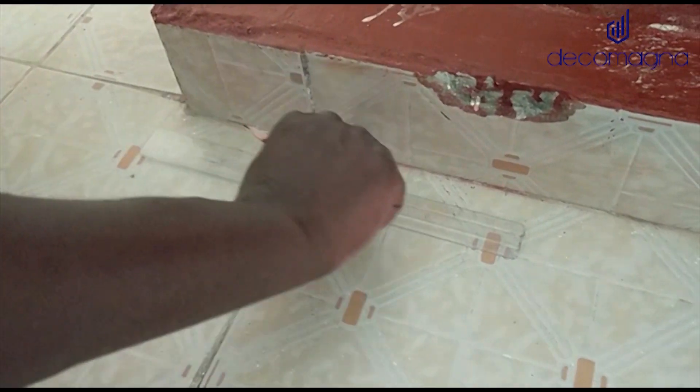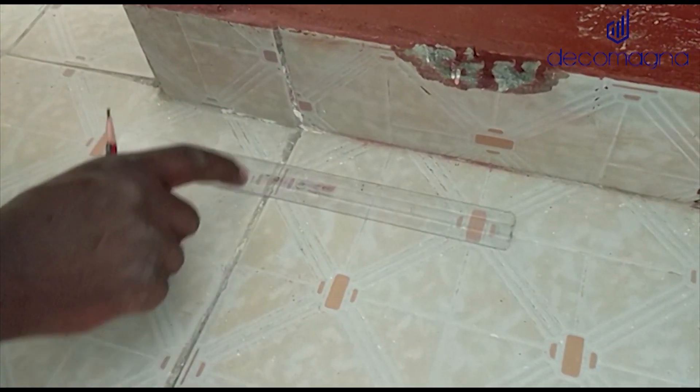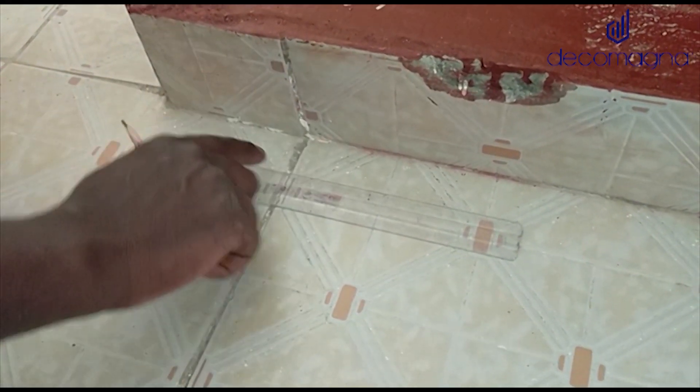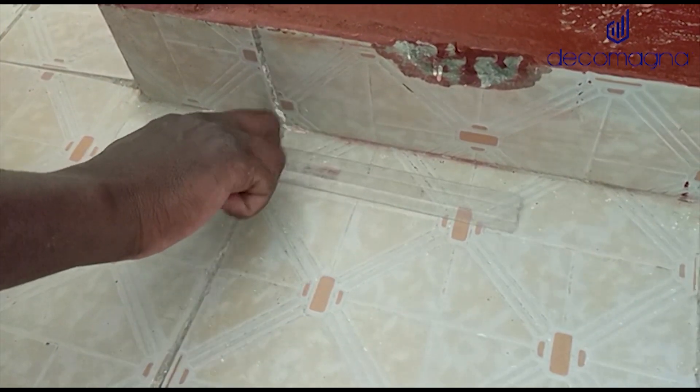Because the profile will be separated from the fireplace — from the laminates — to give space. Aluminium profile again, to give the expansion allowance for the laminate here. Give a good allowance.